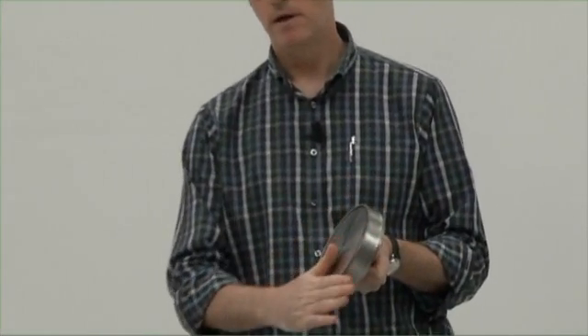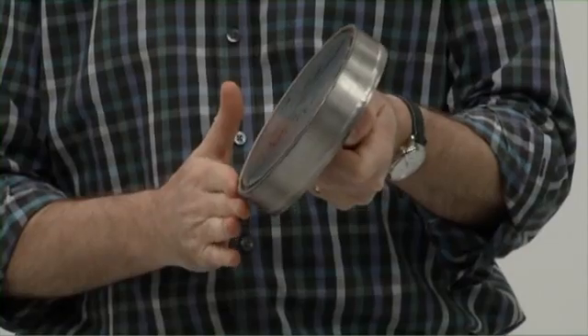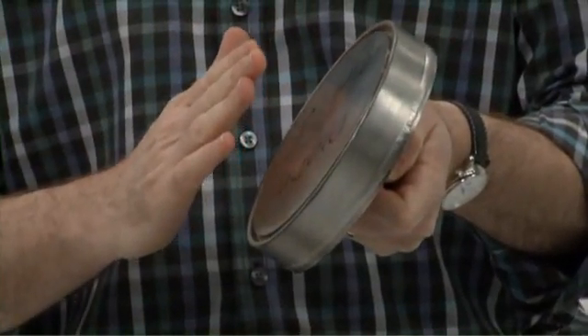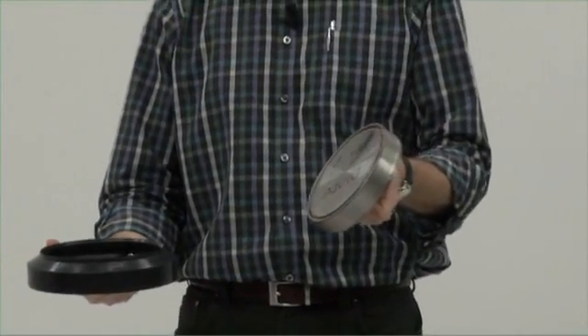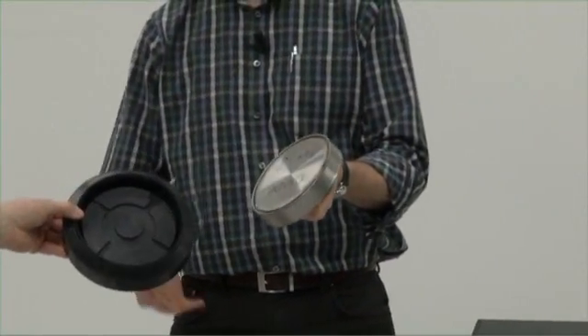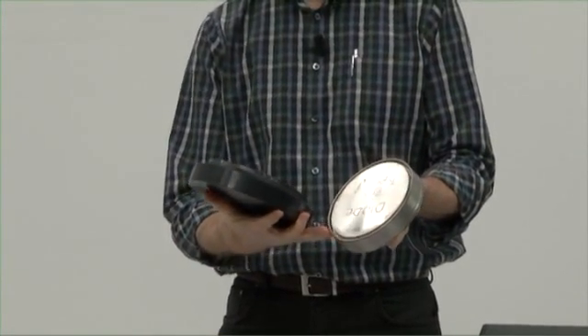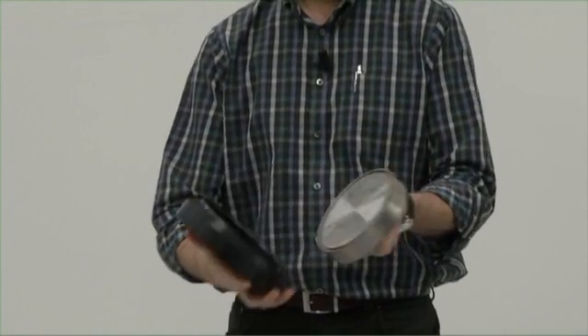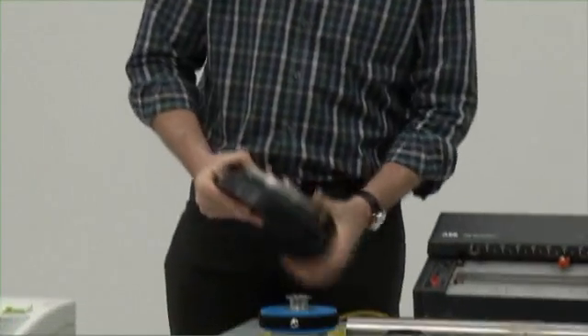In some pipelines we may end up with a fixed flat flange. We can imagine there are many tens of meters of pipeline and we have an end cap which is welded in place. It could be the point at which a system is either incomplete or whether it will be for further upgrade. Here we have a clamshell tool which will fit directly onto the end face. It will keep the zone free of the weld, which is the point we want to test, and we place the clamshell tool directly onto the welded piece to be tested.